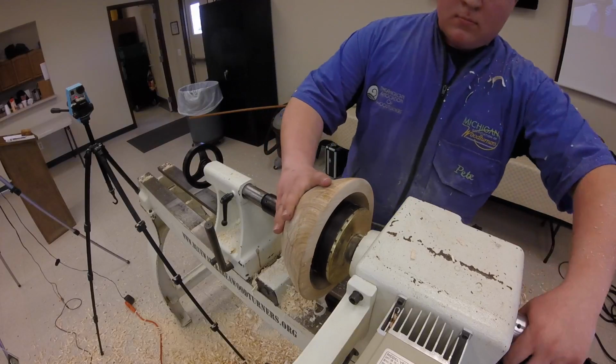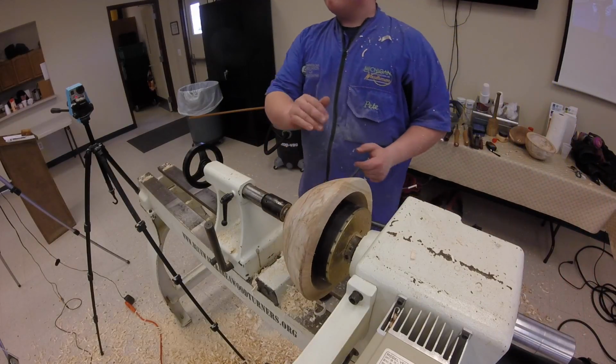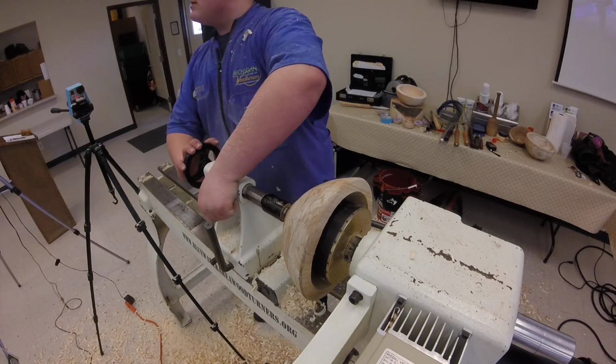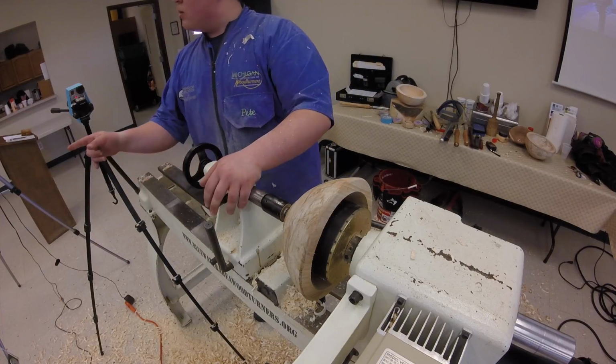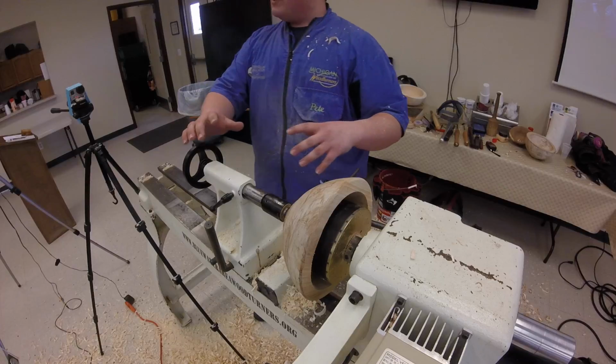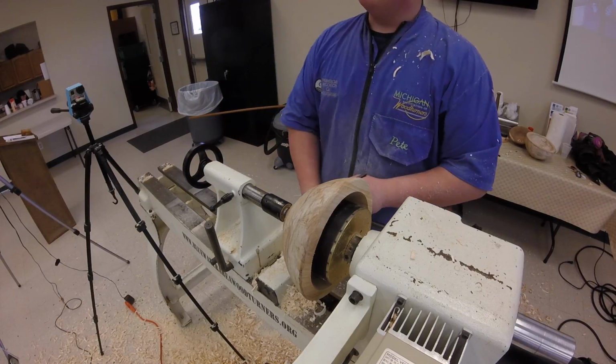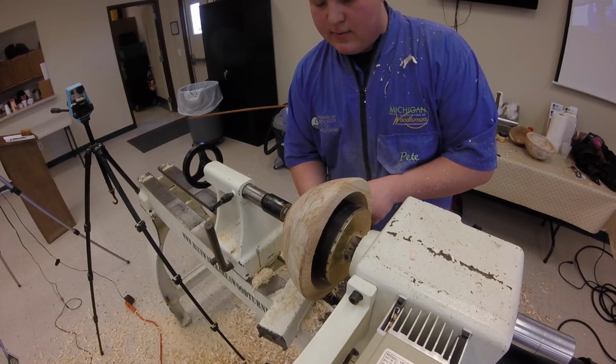Do you ever use mineral oil on your bowls to keep them from warping so much? I've actually never heard of that. What is it? It works, mineral oil. Mineral oil, on the bowl when it's wet? A big brush and load it on there. And it really works? Yeah. I'll have to try that. I didn't hear about that one.